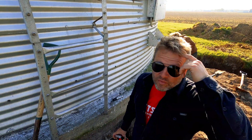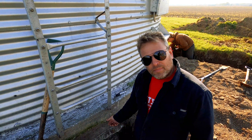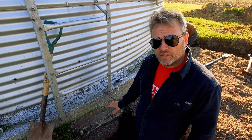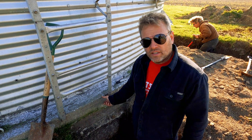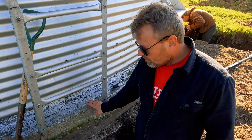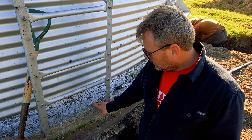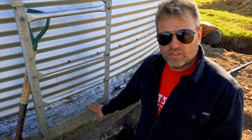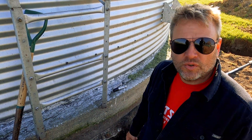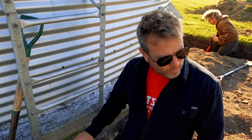We've got to establish our height for our footing — this is the front porch. We're going to be laying a block foundation: two courses of block with a solid cap, and then pour a four-inch concrete stoop on top to cap it off. My finished floor is going to be the same height as our concrete foundation for our silo — that's also going to be the floor height inside the building, so there's no step through the doorway. Nice and gentle for grandparents going in and out.